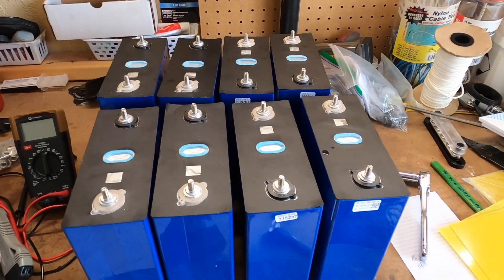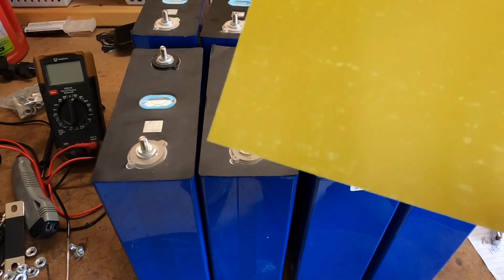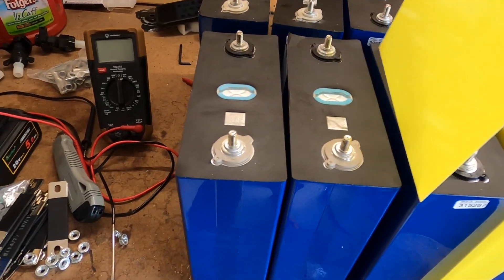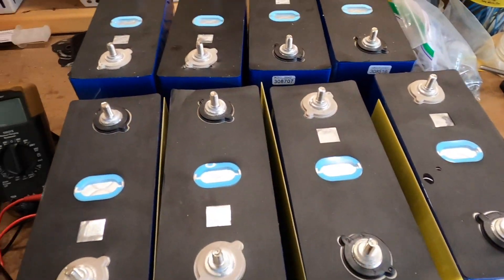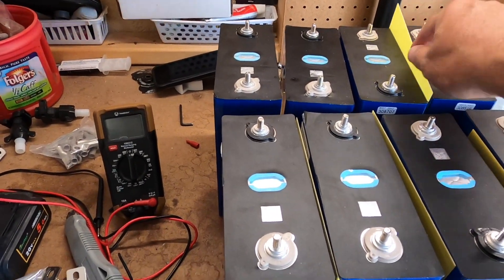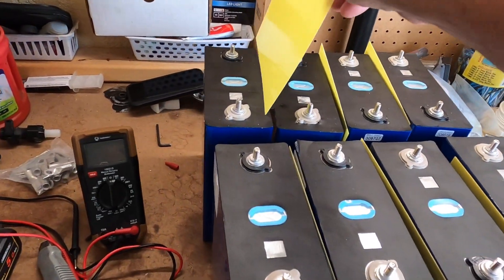All right, so there's the layout of the batteries. One of these fiberglass-ish slip sheets goes between each battery, sort of a protector between the two. LiFePO4s are much more stable than the old lithium, so I'm not sure that's even still necessary but it's cheap insurance as far as I'm concerned.